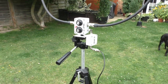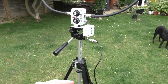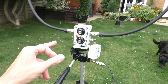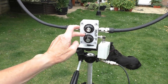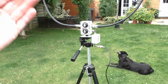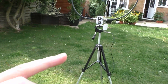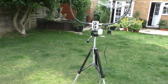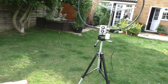As you remember from the first video, it came with no instructions. The setup is quite basic, but this balun — we don't know if we should be using it on HF or if it's for VHF. The controls: we know the top one is frequency, the bottom one is impedance for the SWR, and we've worked out what the band switch does, but we just weren't able to get it to tune on CB — SWR was as high as eight or nine. So really what we need is an antenna analyzer to find out exactly where this loop is resonating.